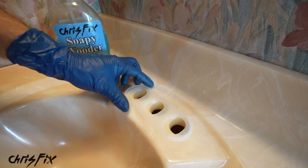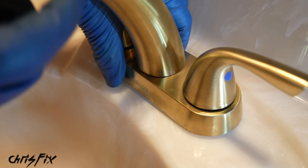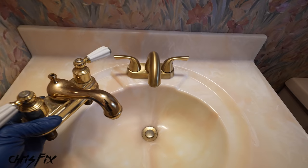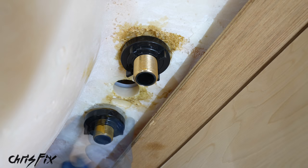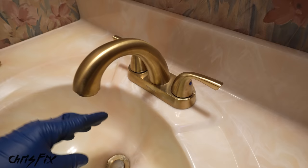With a clean surface, get your new gasket and lay it down over the holes. Then grab your new faucet and carefully line it up so it matches the gasket, making sure it's even all the way around so we don't get any water intrusion underneath. That looks so good — it's more modern than the old one. Now let's go underneath, tighten it down, and get the hoses connected. Tighten down each washer nut by hand, then work back and forth snugging each one up so the faucet gets tightened down evenly.